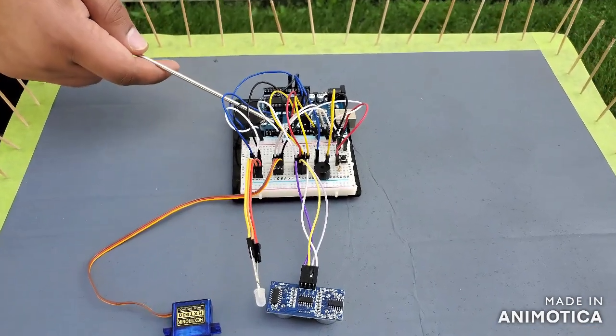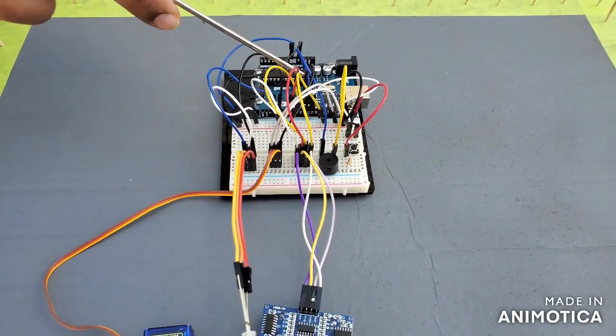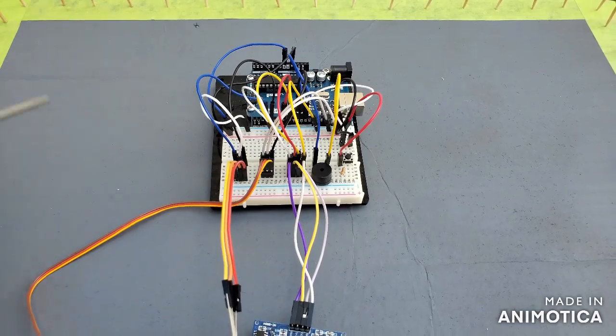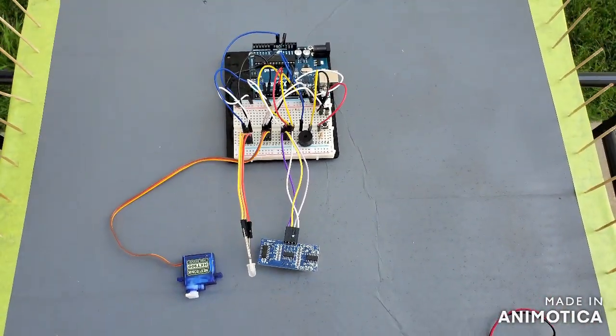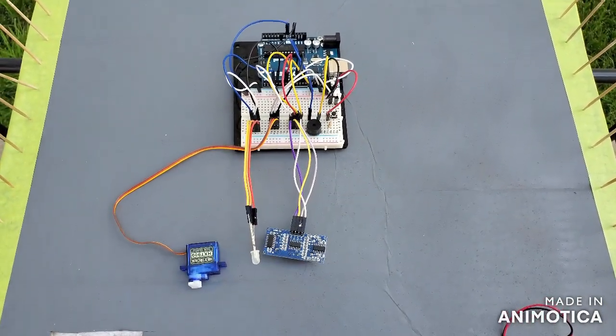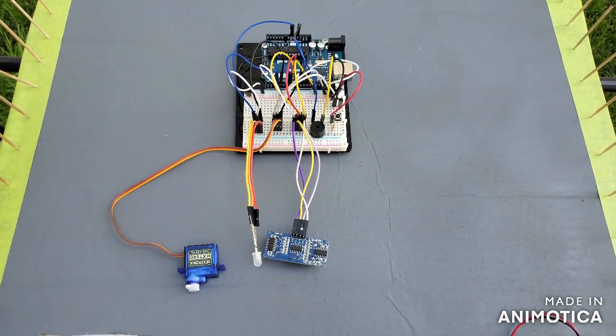The other LED wire goes to pins 3 and 4 respectively, and the servo motor receives input from pin 10. That is how the whole process works — that covers all the wiring. The button is a pull-up button as explained earlier. That's all for control room number one; now we are moving to control rooms two and three.